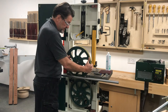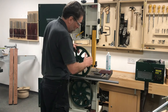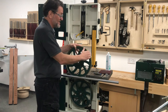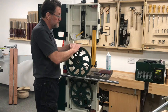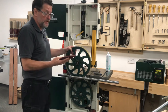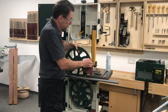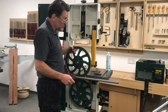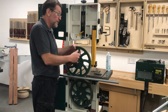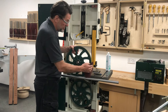A little tip here if you have got the 350 — I just rest it between the two stems on the front rail to take the weight, because there is quite a bit of weight there. That allows us to roll it around and inspect the tyre. This is a rubber tyre that compresses slightly when the blade is in, because it has got a slight crown grind on the front. We check it for foreign bodies, wear, or resin build-up. This one feels in nice condition, but to get rid of any resinous material I use what they call a scratch pad — you just give it a rub round. You can also use wire wool, but do not use a detergent, soapy water, or anything like that, because when that dries it is going to make the rubber crack and we want to keep it nice and supple so it grips the blade and gives you a nice tracking.